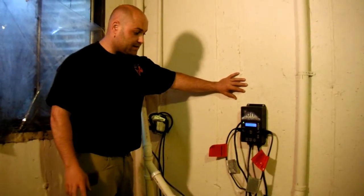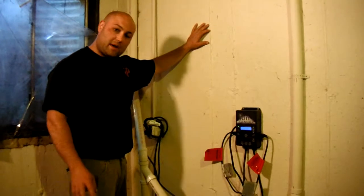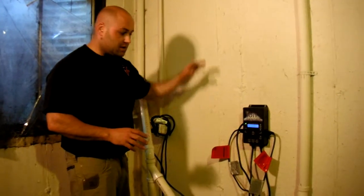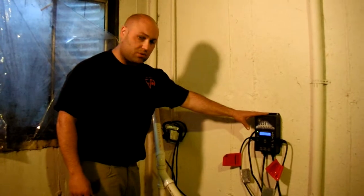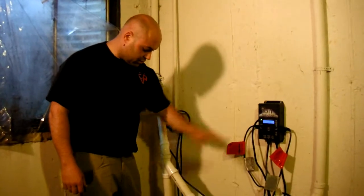The reason why we like this system so much is it has a digital readout right here on the wall. Some things people need to realize about a backup system is that these systems are two main pumps that run in conjunction with each other through this controller. One pump will go off to empty the pit, and then the next cycle this controller will make the second pump go off.